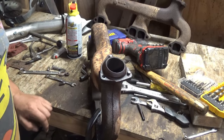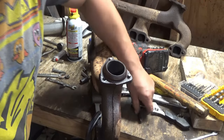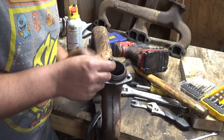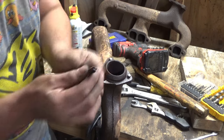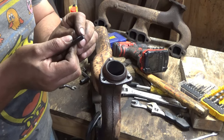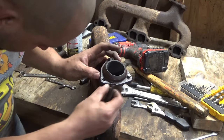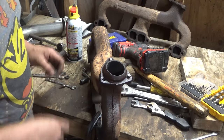I'm going to say it again: to do it right, you have to get that piece out. I just figured that if I messed it up, I'm just going to put a helicoil in it anyway — I had a backup plan. And I kind of figured that once this started going in there, it was going to take the path of least resistance. Because of the way it's shaped, it kind of gradually pulls itself in. I figured it was going to find its way back into the original threads. But I didn't know that my hole was so perfect — I barely destroyed maybe one thread on the top. That's nothing. And it's almost perfect, actually.